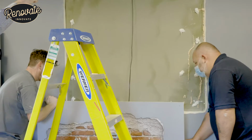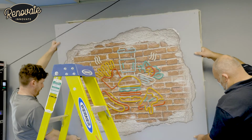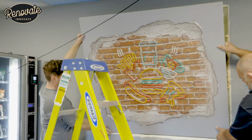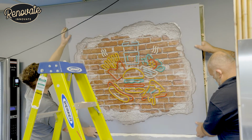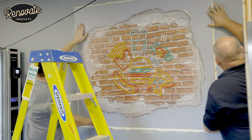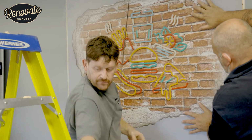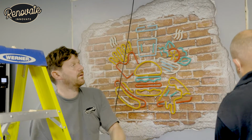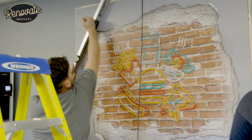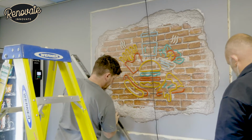There you go, just offering it up, making it nice and flush with the wall. Yeah, when we put this on, when you're offering anything flush like that, it's best to put too much adhesive on the back there, so you haven't got to pull whatever you're using forward, you're always just knocking it back. A little bit of advice. Yeah, if you had knocked it in too far, it'd be harder to pull it out. There you are, simple job.